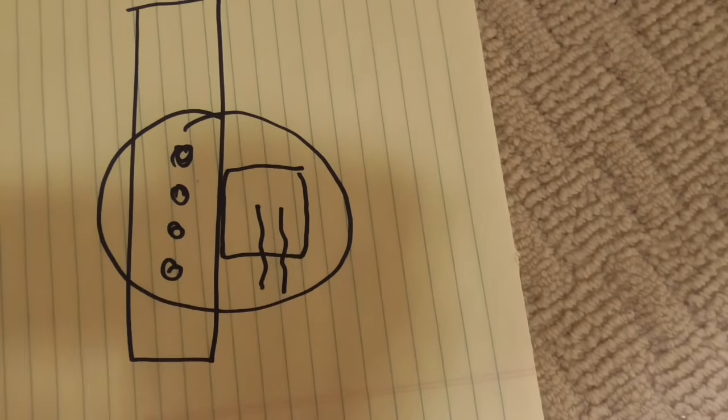There is a lot involved. The instructions are not easy to understand. I've done stuff like this before, and I looked at the instructions, and I was able to put parts of it together, and then I just left it for the installer to do the rest, because it's very involved. But it is doable. So what was done is wire was routed all the way up the ceiling, pulled through with a cable wire snake, and then right at the very top underneath the wall, a hole was put into the ceiling over here so that they were able to drill down through the cross stud, which goes this way, and the wire was routed all the way down to the switch.